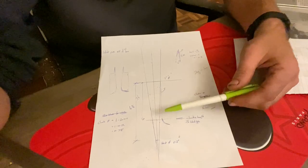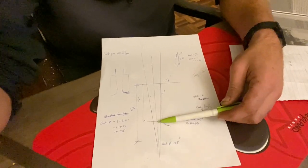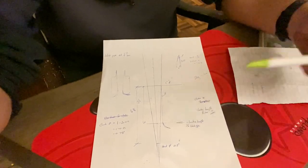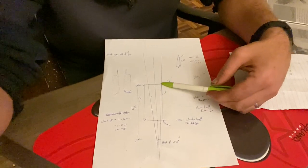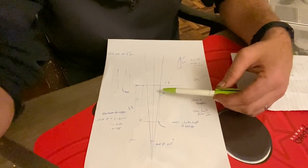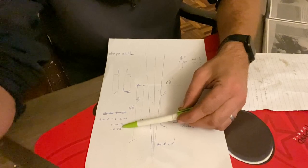I'm not quite sure how I got it so wrong yesterday, but let me show you what I'm coming up with now. The blast diameter is 0.2 inches, which is what I had before. The height from the blast to the choke is seven times the diameter, so about 1.4 inches — that's remained the same. Starting with a two-degree taper on the inside of the chimney going from one inch at the top down to the choke diameter gives me three and three-quarter inches long and a choke diameter of 0.78 of an inch.